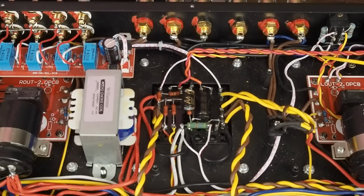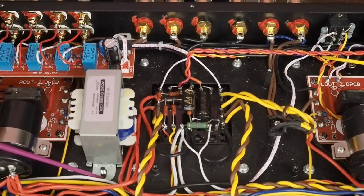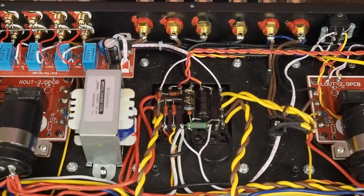Now, luckily, I got on Hammond's website and was researching their chokes, and none of their just standard replacement chokes, generic ones, would fit inside this amplifier and would fix this problem. But then I went and looked at their selection of replacement chokes for guitar amplifiers, and there's a Marshall guitar amp replacement choke, a 194G. It's a 3 Henry 250 milliamp choke that is the exact same size and has the same bolt down pattern as this choke does. So it's a direct replacement.